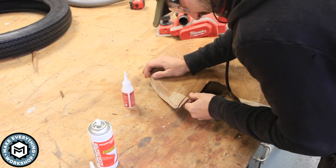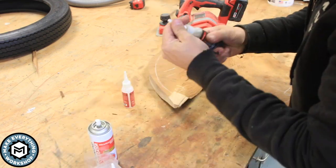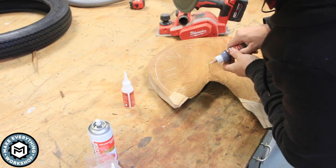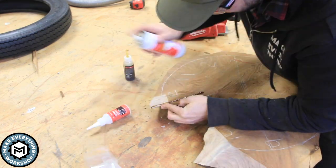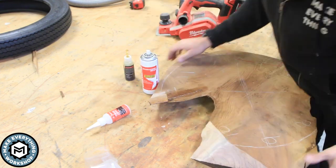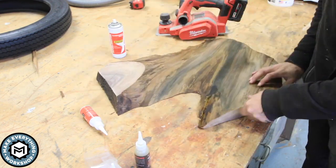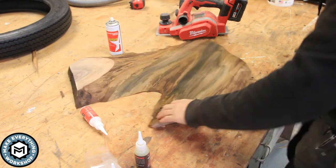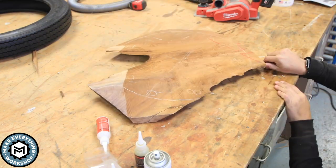I shouldn't have made an attempt at that, but it's okay — I got my Starbond medium brown, put some of that in there and it should be good. With a little bit of super glue to close up that gap it's basically imperceivable in the finished product. Starbond makes glue in a couple different colors, which is cool. I used the brown with some activator and it really just hid the crack completely. I went back with the planer and just planed down a couple more spots to try to level it out.